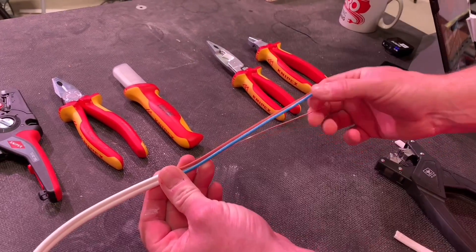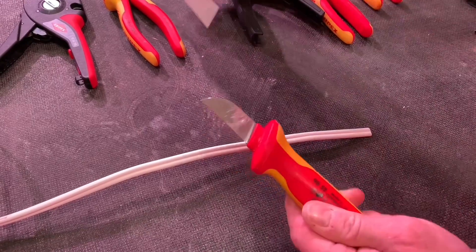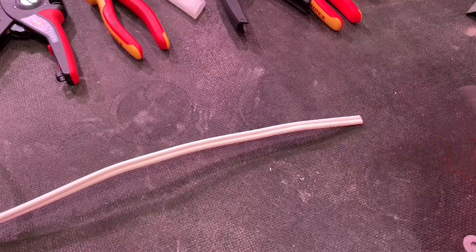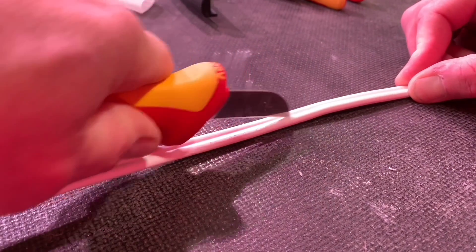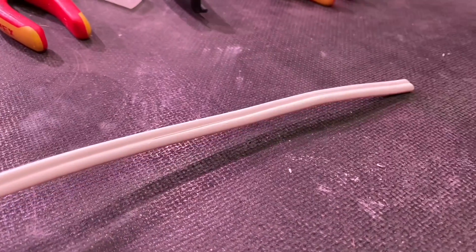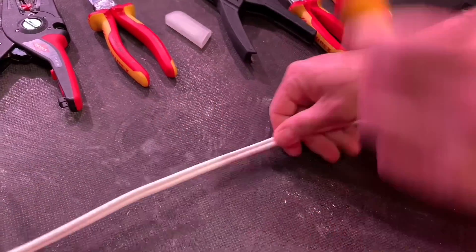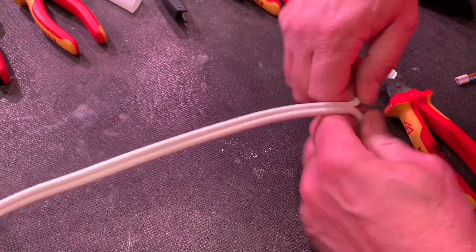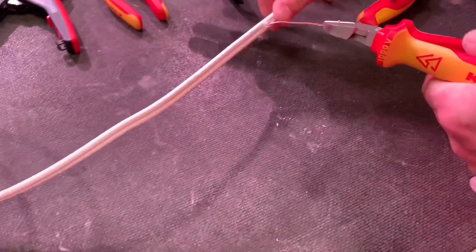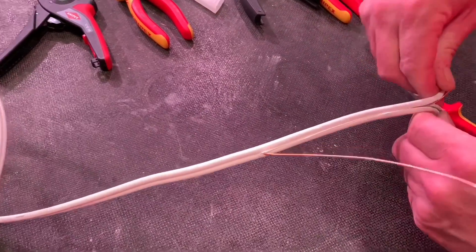Now using the knife method. There's a groove down the centre of this Doncaster cable to make it easier — I'm going to put a little score down here, keeping fingers out of the way, score down and then go around the end point to break it off. Then using the traditional method: split with side cutters and pull the CPC through the middle. The knife running does make it a fraction easier — just gently pulling that down to the point at which it breaks, and that was not difficult at all.